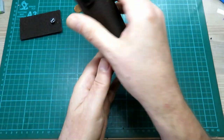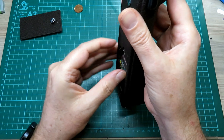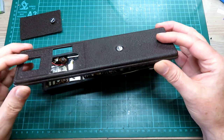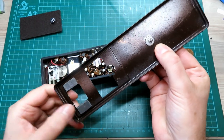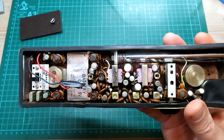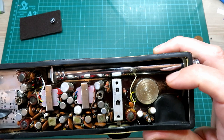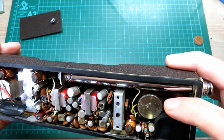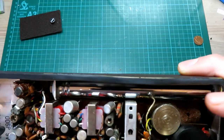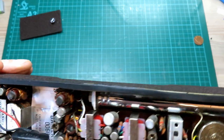He's left a battery in it, so let's just check and make sure that's okay and then we'll do some testing. I thought I'd take the top case off - that screw there lifts the top case off. That's an all metal affair, as you can see they're sprayed with that colour. Wow - now it is a little bit delicate. There's some foam in the back there which I've got to be careful of, I don't want to get any cleaning spray on there. You can see the antenna lead appears to be just tacked onto the outside of the antenna there, which is slightly strange.